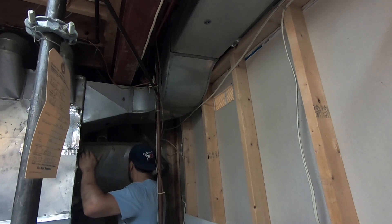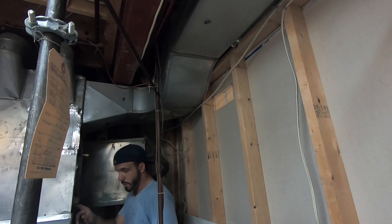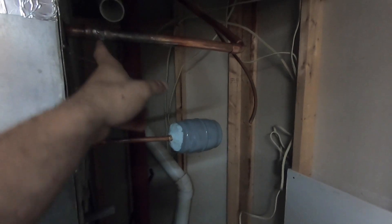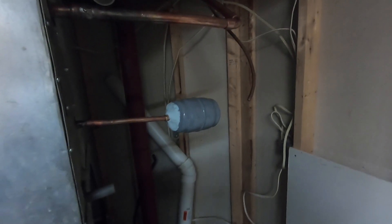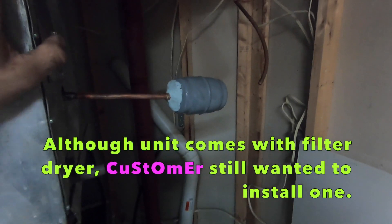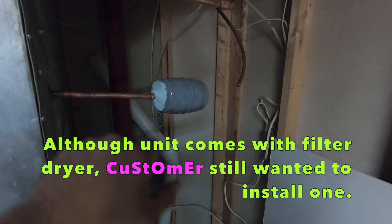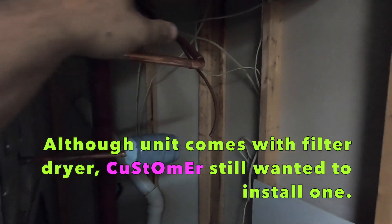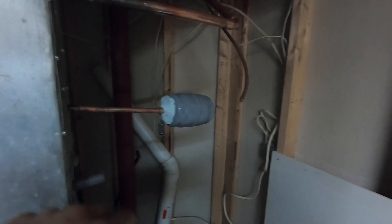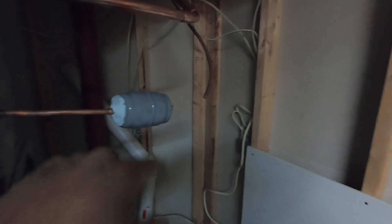Measure up these, make some holes, make sure the drain fits. Alright guys, I have to braze these two before I close this panel — it was a little challenging to get it in there, but I managed. I installed the filter dryer, made this nice and straight. I'm gonna braze this up — the nitrogen is on outside and it's flowing — and join this together.